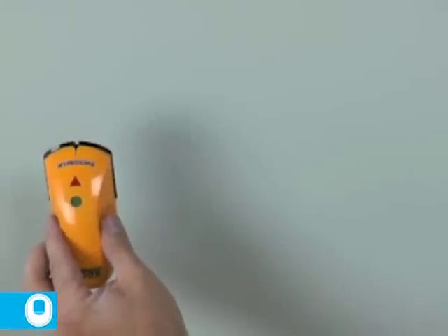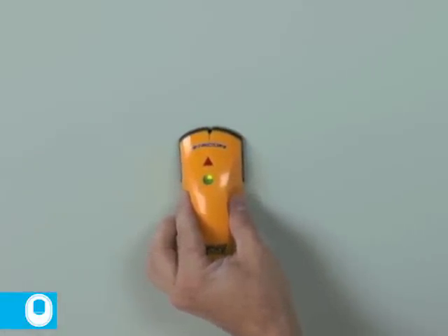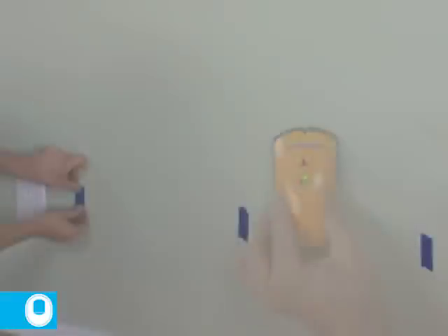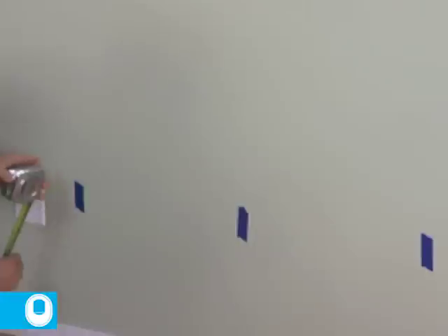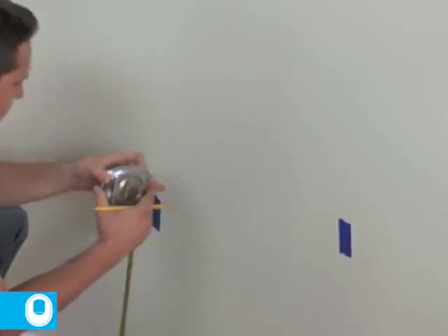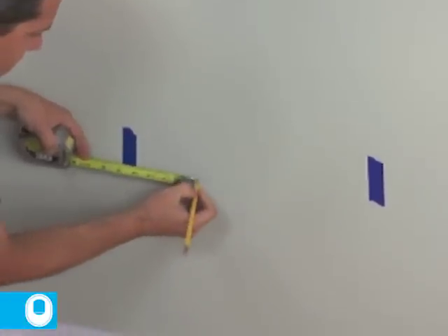Locate the studs within the wall in the vicinity of the television. The boxes need to be spaced at least two and a half inches away from any stud. Mark the nearby studs. Most studs are on 16-inch centers; occasionally, depending on the construction of the house, other studs may be present. It's better to know where they all are before beginning the installation. You also need to have a receptacle nearby. You may want to place your bottom box such that it is level with the receptacle. Measure and mark the wall accordingly. Place another mark on the wall that is at least two and a half inches from the nearest stud to make sure the box installs easily.